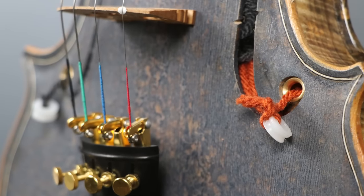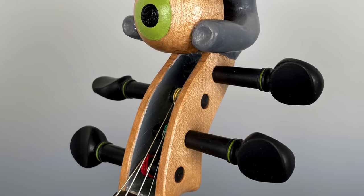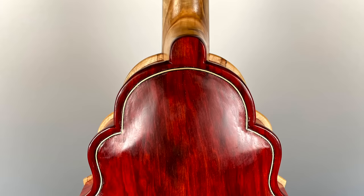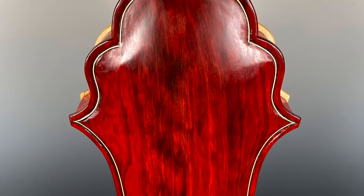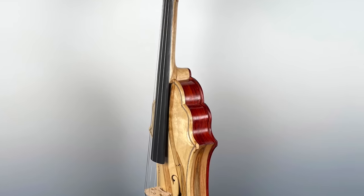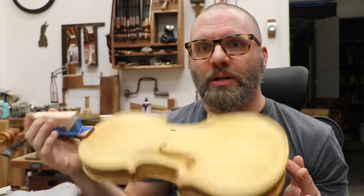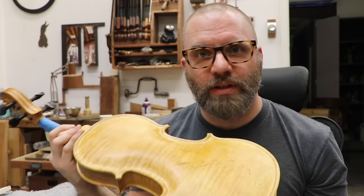And so I will actually use the natural color of the wood with a French polish on top, with some oil to pull the natural tannins of the wood to the surface. Now, but in this case, what I'm doing is that shellac sealant and then a coloring technique to get the color that looks more like a traditional fiddle or violin. And then this will be finished with a varnish, unlike traditional shellac finish that I use.